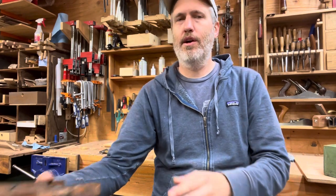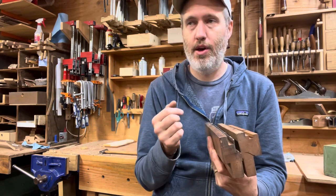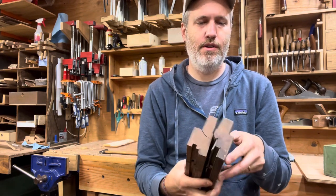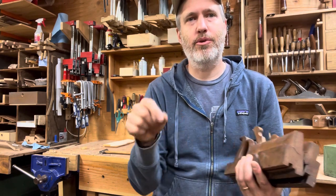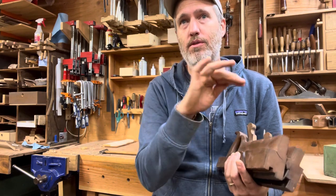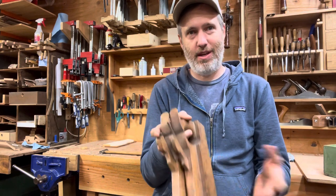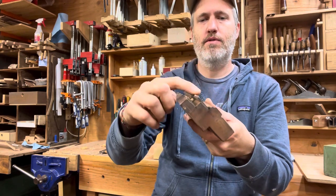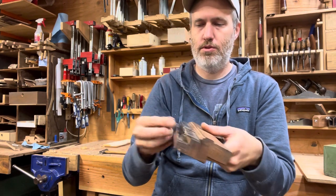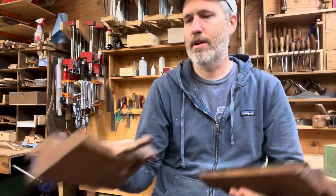The next two I think are even cooler because they are a matched set of tongue and groove planes. Tongue and groove boards are really useful in all kinds of cabinet work — for the backs, for shelves, for whenever you need to join two boards together like that. I could see making little tongue and groove bottoms and tops for the little ukulele cases. These ones do not have a maker's mark — they just say 7/8ths, so they're for 7/8ths inch boards, number 10. They do have some iron or brass on the soles and fences, which helps keep them accurate. This one does have a split right there, but I think it's okay.